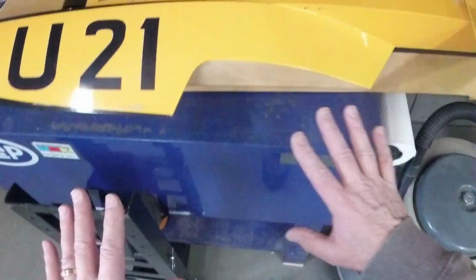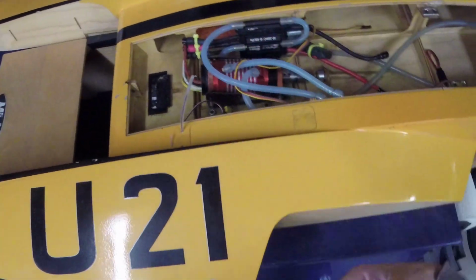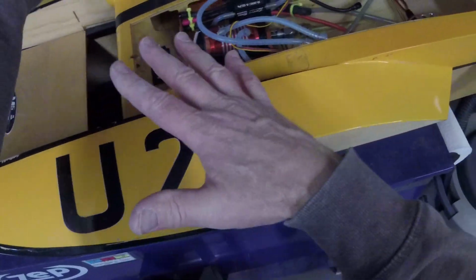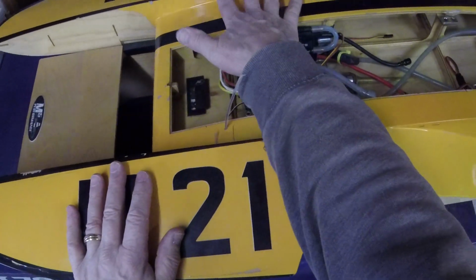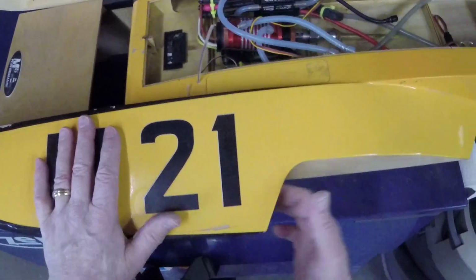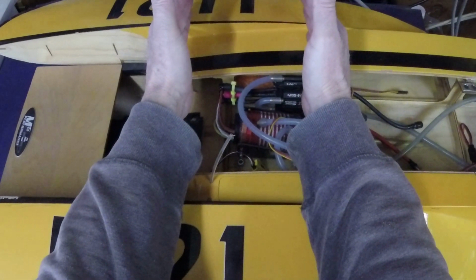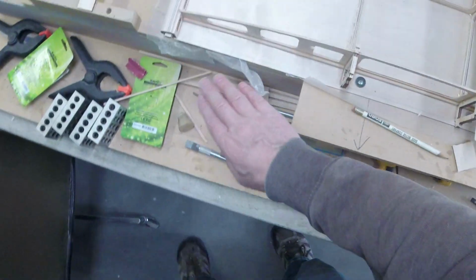You've noticed, presumably, that this thing's a big kite up here in the front. There's a whole lot of surface area causing lift. So we've got to lay a lot of weight right here, pretty close to in line with the turn fin, slightly forward. We're kind of targeting our sponson transoms a little bit, to get this part pretty heavy right here. So everything goes up there.